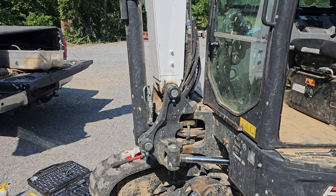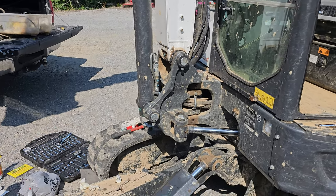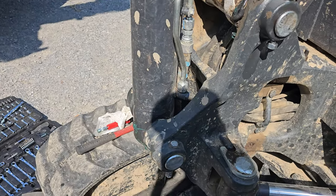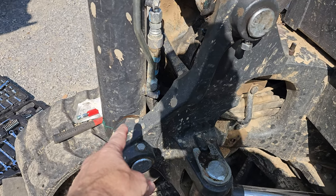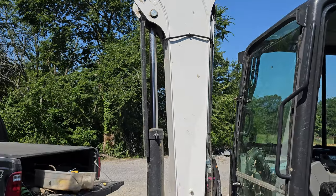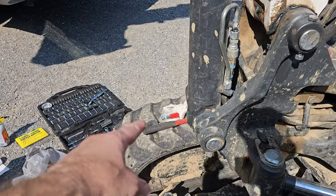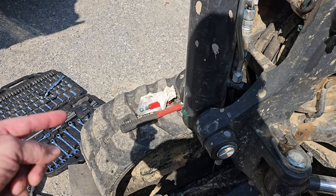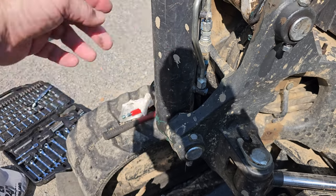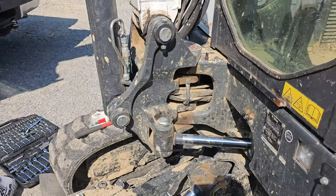Double winner winner chicken dinner! I was about to give up on that grease zerk, but I thought — let me try moving the boom to far extremes to change the pattern of the grease. I brought the boom all the way up, then hit it with the grease buster again, and by golly the piston was going down. I hit it with the grease gun and it made it all the way out where it needs to be. Double prizes!